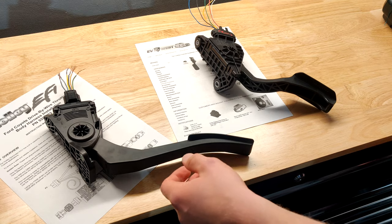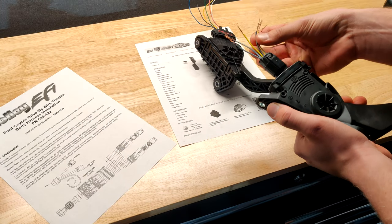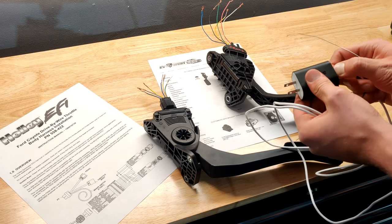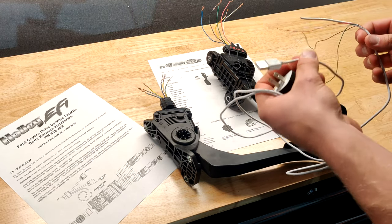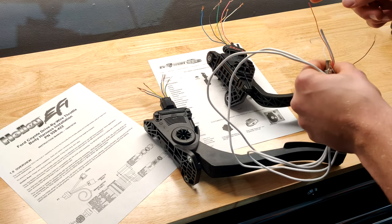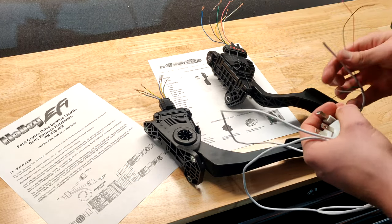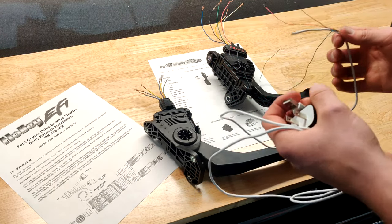But you may not be as lucky with every pedal you're planning on using. So one way I've figured out to test these pedals is to use a current-limited five-volt supply. If you don't have access to an electronics test bench, what you can also use is a USB charging brick and a micro-USB charging cord that's cut open, which is what I did here. A USB is a five-volt standard, which makes it perfect for testing these five-volt Hall Effect sensors. You just chop off the device end of your micro-USB cord, identify which of the wires is positive and negative, ignore the others, and wire these up to the different connections until you get a proper reading from your Hall Effect sensor.